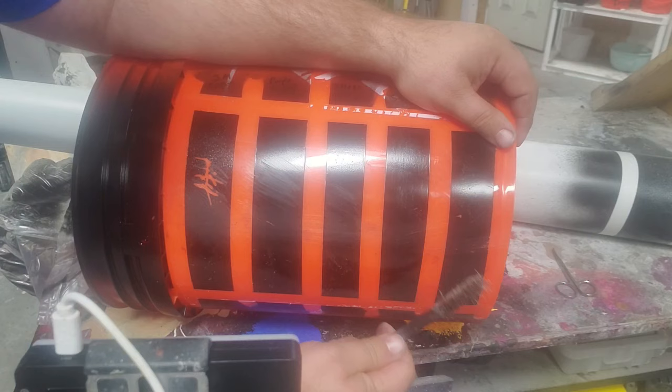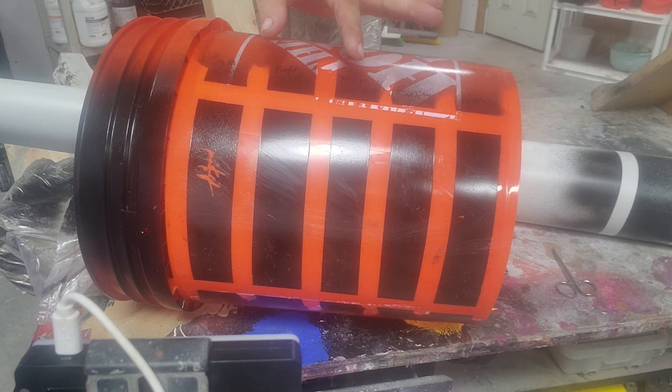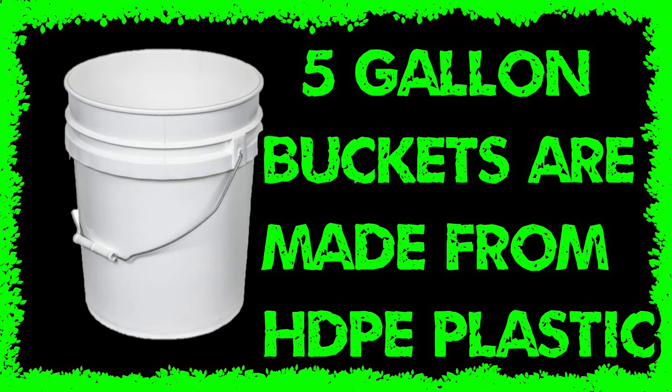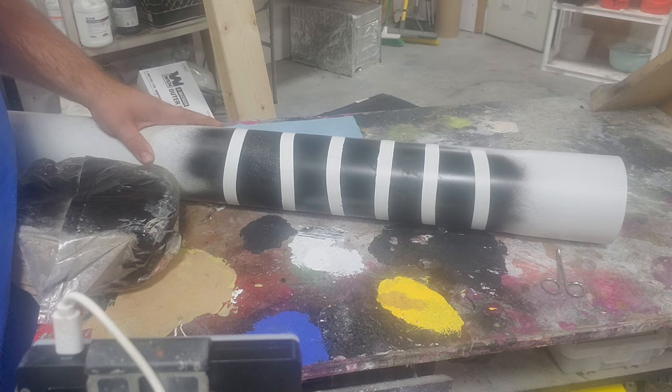So nothing didn't work very well — it held okay but not great. Sanding works pretty good. The xylene and contact cement works the best, and the purple primer works the best. Those are the two that are going to prep your plastic project the best, on five gallon bucket plastic. Let's look at a piece of PVC pipe.